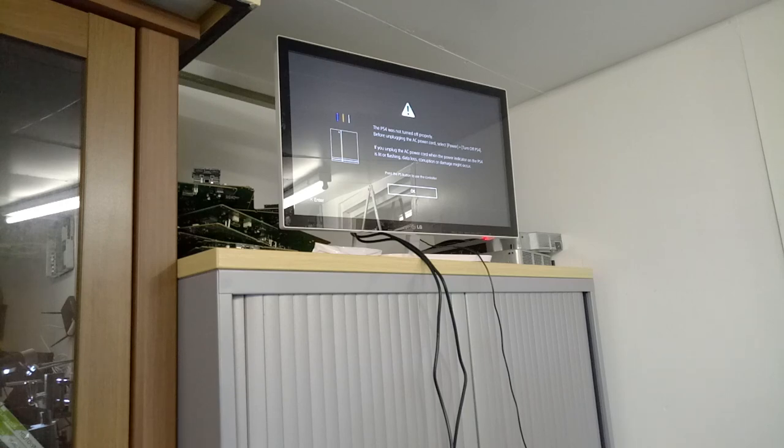So what did we have to do there? Well, it was a bit tricky. Originally we were having an issue with this PlayStation because we couldn't actually get an image on our display and we had a white light. The first thing that jumped out at us was the HDMI port looked like hell, and indeed had the first four pins on the left bridged, and the two pins on the far right also bridged. So what we did is we actually removed that old port and reinstalled a new port. From there we still had an issue of white light. The most common place to look from that point on is the encoder IC, because the encoder IC is the first part of the circuit which sits directly behind the HDMI port and is particularly susceptible to things like surges from TVs and lightning strikes.